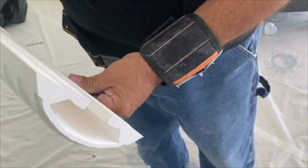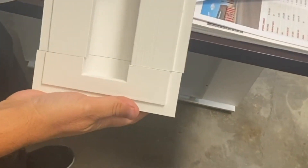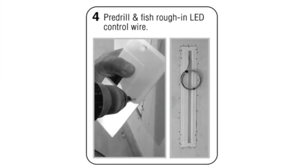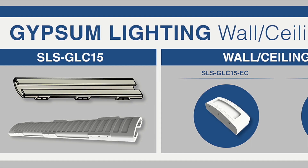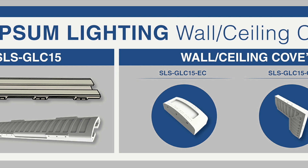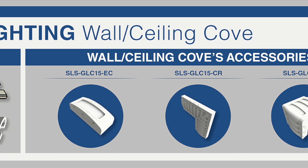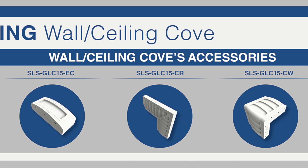It's also field cuttable and could be chopped in the field. And then to make it easy, we make accessory pieces that cap the end or corner the end if you wanted to continue transitioning from ceilings or from ceiling to wall. This is just a nice way to terminate the end so you don't get a harsh glow of light at the end — you can stop the strip light maybe an inch or an inch and a half away from the edge. A lot of the channels we see today, you just see a hot spot when you get to the end, or if you cut the LED tape shorter on an aluminum channel, you actually see a shadow or a dark spot. So we'll be able to solve these problems with our channels.